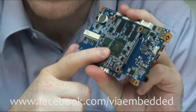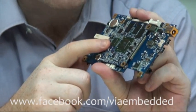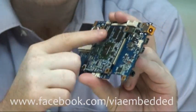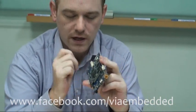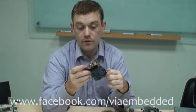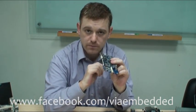The chipset on this one is the VIA VX820, and here we have a C7N ULV at 1GHz. The system memory is also on board — 512MB of DDR2. So your computer is entirely on the module, and the carry board gives you all your IO, including USB, power, audio, and display technologies.